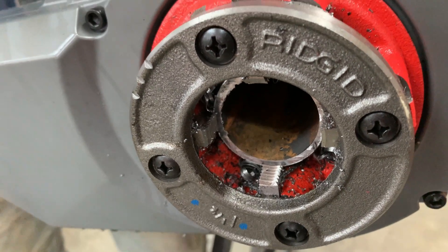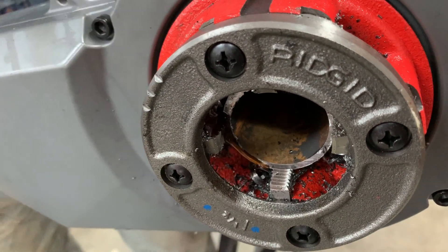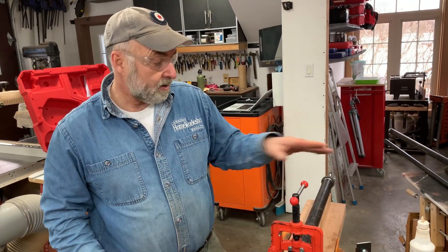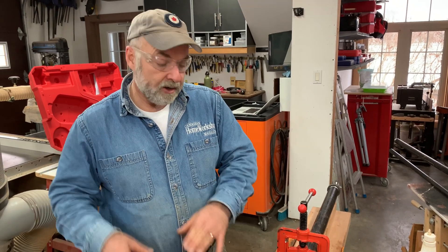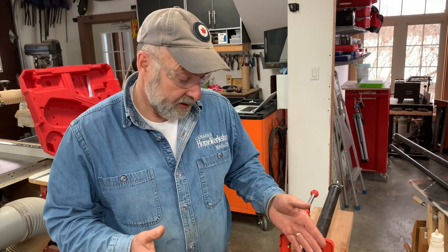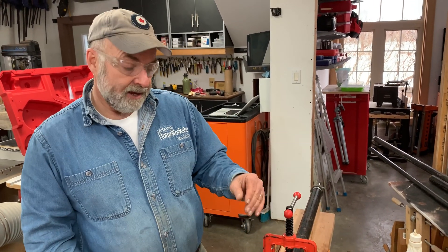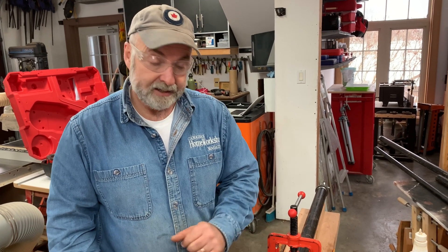Can you see how it's digging in there? Didn't have to put on very much force at all to get it started. As I've learned with this tool, you basically run it full blast. Once it's started and once you've got it lubed up, you just pull the trigger all the way and let it roll. When I first started using this tool I thought it was a big pipe so I'd better go easy, and I only gave it a little gas — it actually cut out on its own. It has an internal system to prevent overheating, and not running at full blast caused it to cut out to protect itself. Running full blast, there's no problem — that's tip number one.